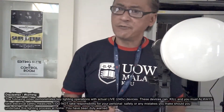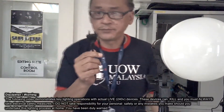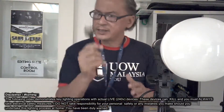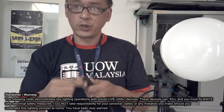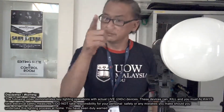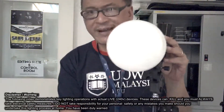What if you buy a bulb or a fixture that has only two wires? This three-wire one was easy to wire up, but if a fixture has only two wires, you can take one and put it on the brown wire — the live — and take the other and put it on the blue wire — the neutral. But where is the ground wire? You need to do some modification.